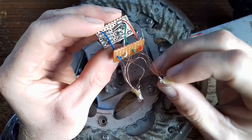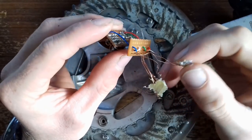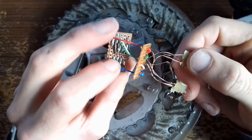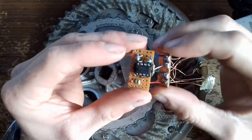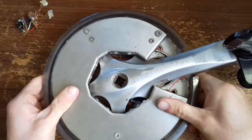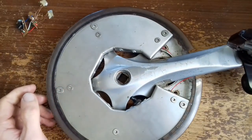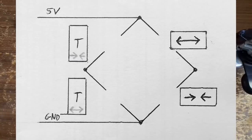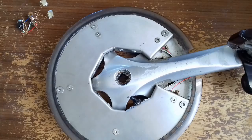These are the wires I used to connect the strain gauges. That's the two-part glue I used to cover them up — I'm doing that differently now. The strain gauges are arranged in a full bridge arrangement. I've got two for temperature compensation and two that do the actual measurement, so they're basically orientated 90 degrees to each other. Anyone who knows about strain gauges will probably know about that.